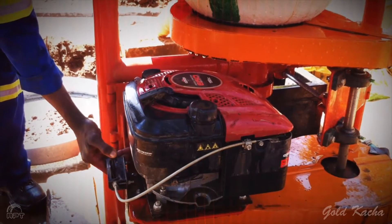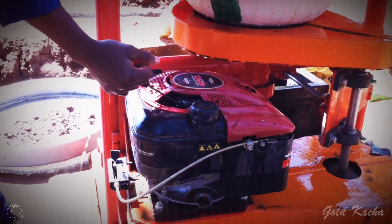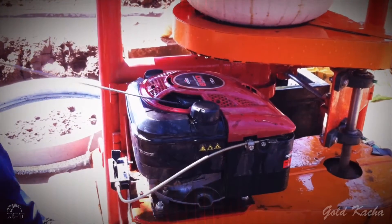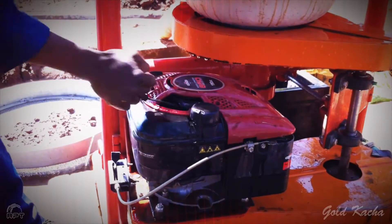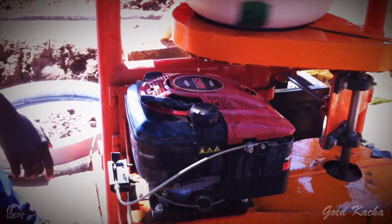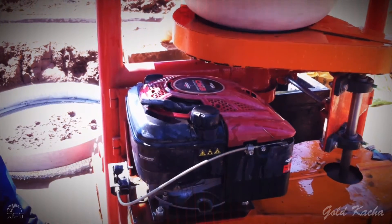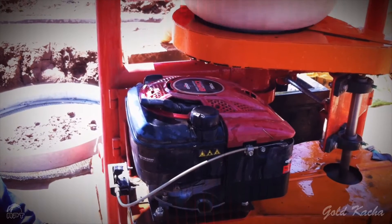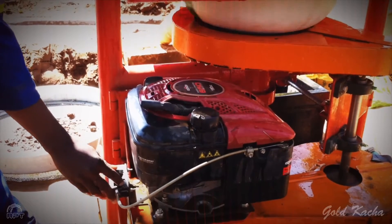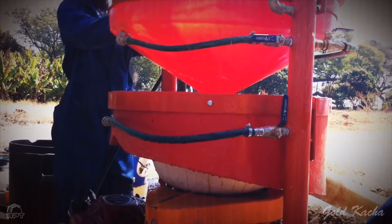To begin, you will have to start up your new machine. If you have the electric motor version, startup is very straightforward and involves switching the main breaker on. If you have the petrol motor version, as shown, you will first have to move the throttle into the start position. Next, pull on the start cord handle, taking care not to injure yourself or others — you may have to pull a few times until the motor starts. Adjust the throttle until the bowl rotates at approximately 100 revs per minute. You can measure this with a digital tachometer, or simply count the number of times the black patch on the bowl passes your view in one minute.